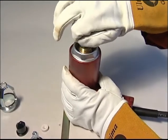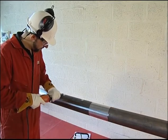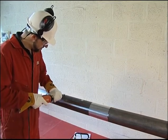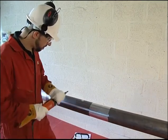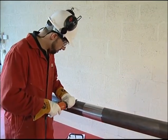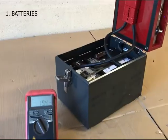When attempting a braze, safety is essential. Correct PPE must always be worn. This includes goggles for grinding and for anyone located within 3 meters, minimum shade 5 spectacles for brazing, flame-proof overalls and gloves. For the process, there are 5 key factors to remember.